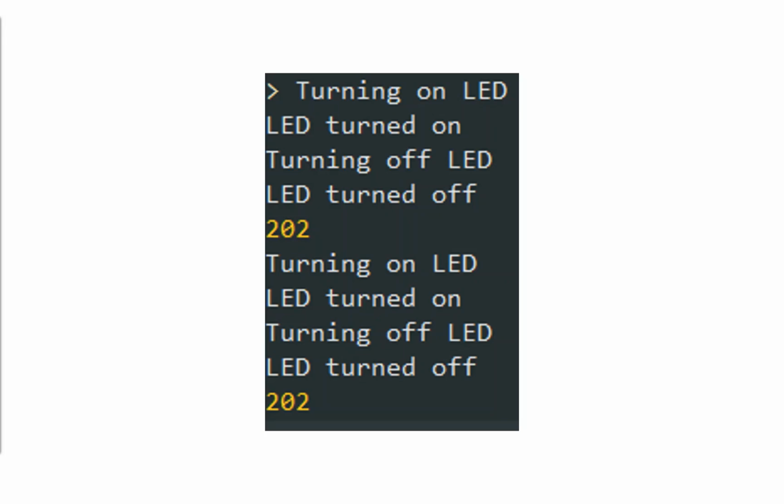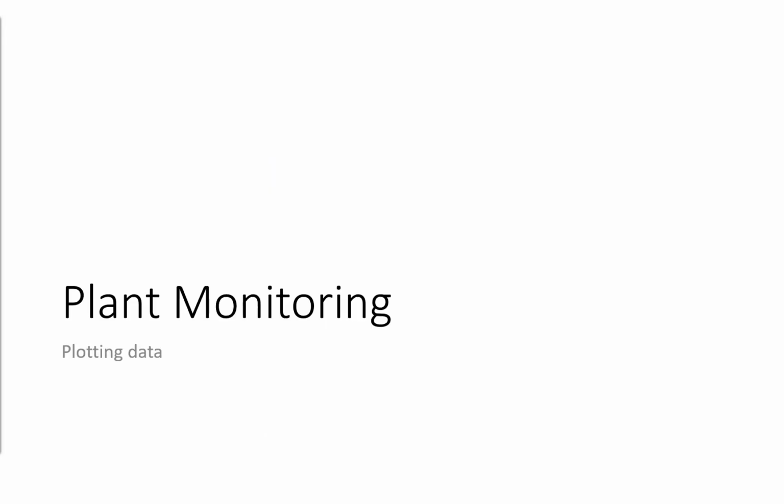Now, one thing that I haven't covered in this presentation for this little bit so far is there's always niche cases like debounce on the board for those buttons. So debounce is the notion that when you push the button, if you don't quite push it all the way, it will hit the contacts, it will release the contacts, but you're still pushing on it, so it then makes the contact again. And that will ultimately result in it sending 2 requests. For this basic demonstration, I haven't factored that in, but there's no reason why you can't with a simple delay or some kind of a timer in that as well.